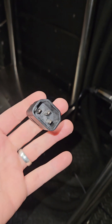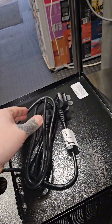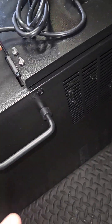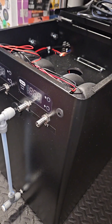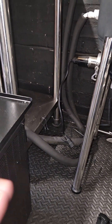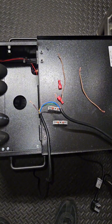It's got a kettle connection on the warming wizard, so I've bought an actual kettle connector which is going to the plug socket. We're going to splice this active cable — I've got some extra wire with some connectors — so we divert the power source onto the switch and then back into the connection going onto the plug socket. This way it can switch on and off, and when it needs to heat it will turn the power source on and off for the warming wizard.